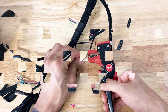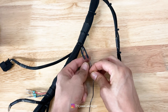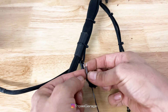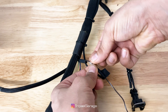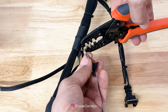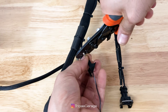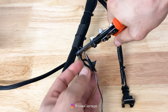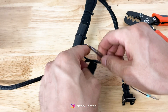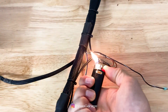Let's get the opposite end of the sensor wires ready to crimp together. I like to fold the wires going the opposite way before I crimp them to give them a strain relief. Get your brass crimp on the wires and crimp them all together. Do a tug test to make sure the wires are secure, then wrap up the crimp so no metal wires are exposed.